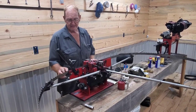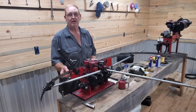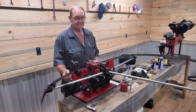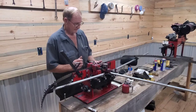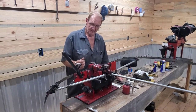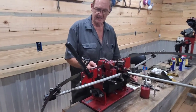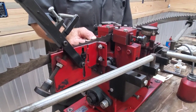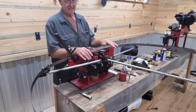On the sharpening aspect, if you get a blade that's double-hardened out on the tip and you set your angles too high up on the tip of the tooth, you will snap it off. We saw that just the other day with a subscriber out here — we were trying to set a blade and every other tooth was wanting to snap. You have to drop down toward the gullet a little bit, never push on the tip. That way you can do very well in setting the teeth. I set at 20 thousandths.